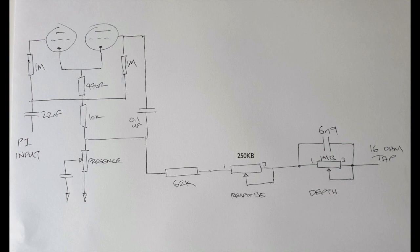The rest of this schematic is a stock Marshall-style phase inverter setup. I didn't actually trace this amp to confirm, but I'd put money on the fact that it's identical — all of these amps always are. Your signal comes through the preamp and into the phase inverter on this side. Negative feedback comes in on the other side of the phase inverter, and this is how the negative feedback coming back from the speaker makes its way back into the amp.